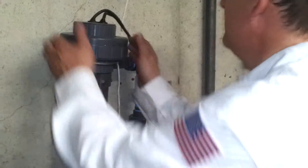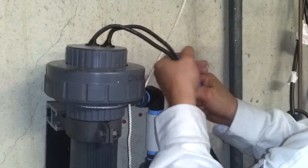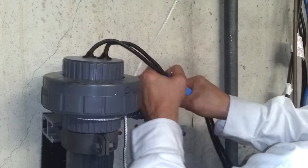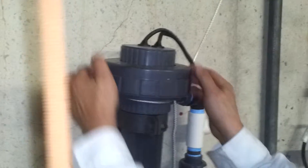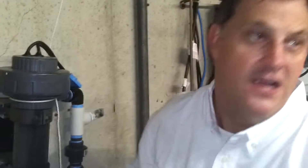The next device is the chlorine conversion stack. We've got our shutoff valves already taken off. This plug unplugs — it takes a little bit of work because it's a tight one. My hands are wet. Don't ever do this with the electricity on. Now we take this collar here. I'm going to release this a little bit to release some of the pressure. We'll see some water come out of there. I only opened that valve a little bit to release some of the back pressure so we can get the cap off.